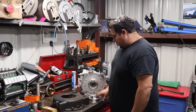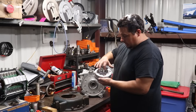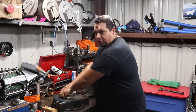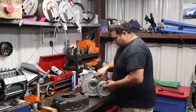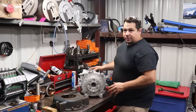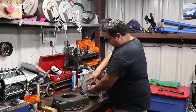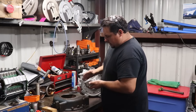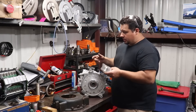I just got done machining the adapter — I machined the outside diameter and the inside diameter all at the same time. The outside diameter is basically a press fit into the Kubota bell housing, and the ID fits really snugly on the generator. Both are about a thou and a half under, so it's tight but not a fight.